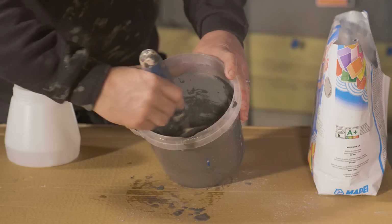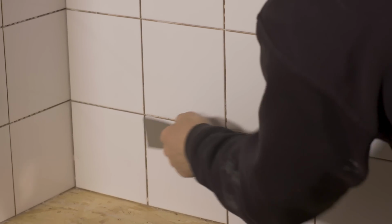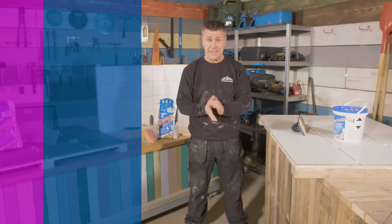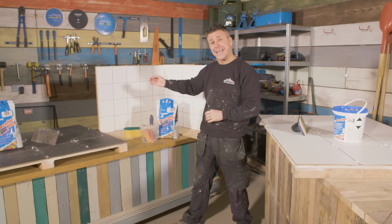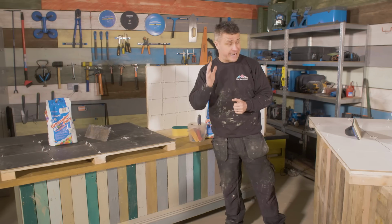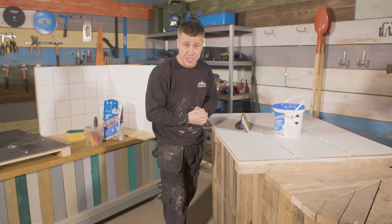In this video, I'm going to show you how to grout wall and floor tiles using 3 different types of grout. The first grout I'm going to use is a standard one for ceramic wall tiles. The second grout is going to be a flexible grout designed for both floors and walls if there's any movement in the area. And the third one is going to be epoxy grout. That's when you need a really waterproof finish.